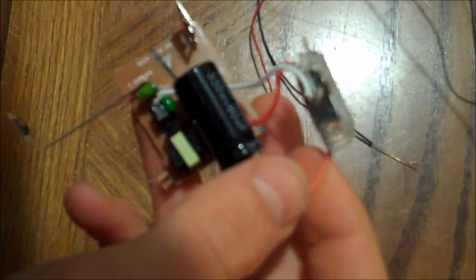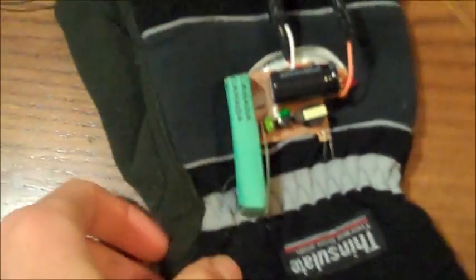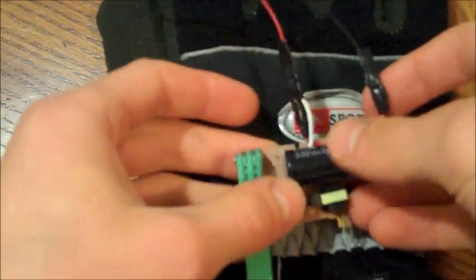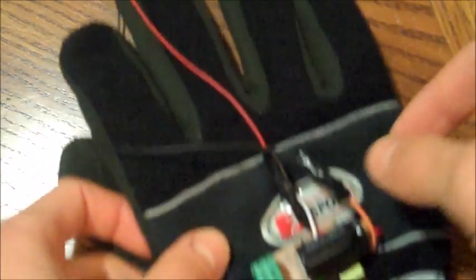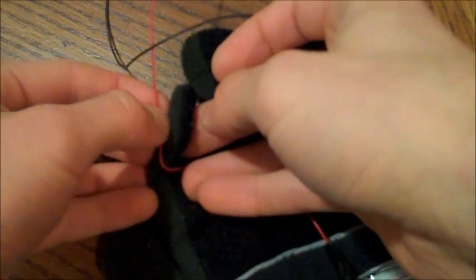I'll just do that off camera because it's pretty simple. What I've done here — I've also added an elastic which holds the battery in nicely — as you can see, I've simply taken off the flash and connected my longer wires from my USB cable to the orange and red ones. The white one I simply tied up here, it's a grounding wire, doesn't really matter what you do with it, it's not needed. So now the next step depends on your exact design. You're going to want to measure. First decide where you want the little board — I'm going to say right around the middle on the top — and then decide what two fingers you want to shock, so I'm going to do these two fingers. Then measure where you want the wire — mine's going to probably end up right around there — so I'm going to cut mine right about there for the red wire, and then for the black wire going on the middle finger, I'm going to measure it, going all the way up, you might loop it around the finger.